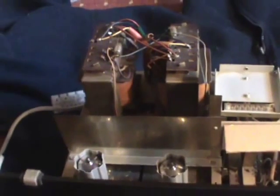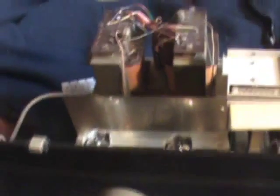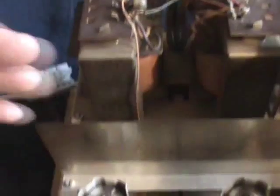You can get some really nice audio out of a single-ended amplifier, and it's a standard amplifier. These are lovely audio transformers. Bit of a shame, because where they mount down there, these transformers don't have a place where I can bolt them. It's unusual how they are. So we're going to have to find some way, and have to be very careful on where I actually position these transformers outside of the EL84 tubes.